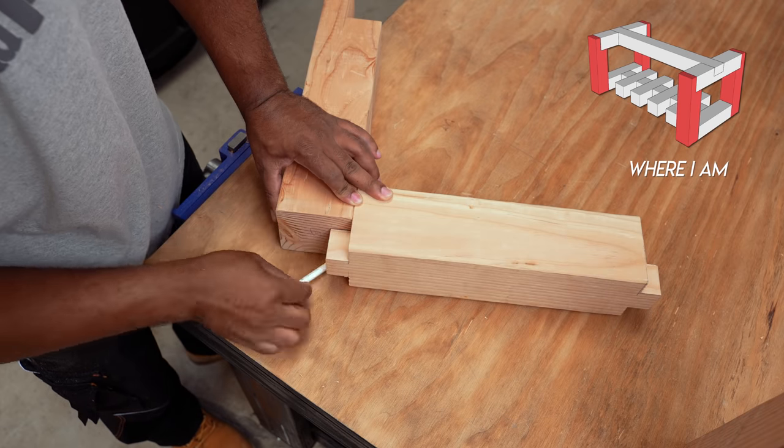Now that the wood glue has set up, I'll use the chisel to clean up some of the joints. The chisel does a good job shaving things down, and the sander cleans it up. Now I didn't mill the 4x4s, I just cut parts and fit them together. The added accent parts at the bottom are the only thing that has a sharp edge on them. To make those blend a bit better, I routed those sections using a roundover bit.